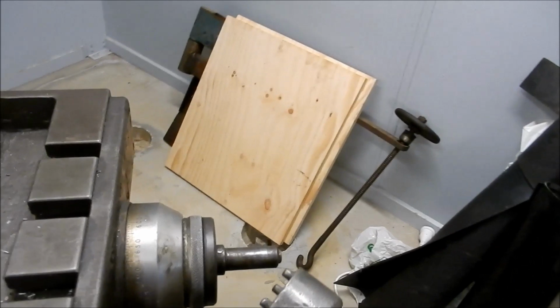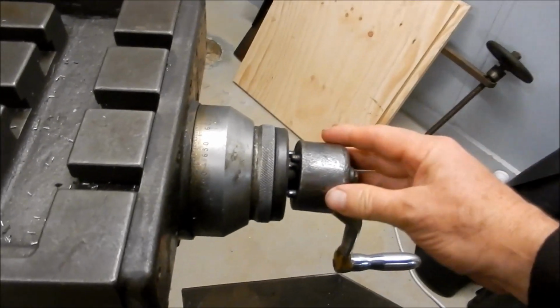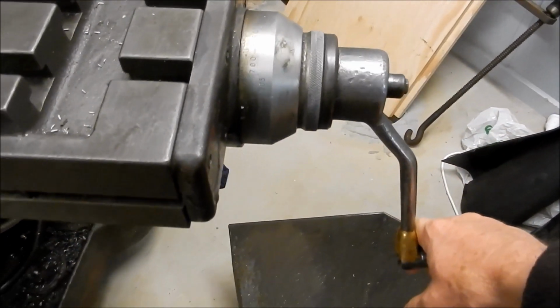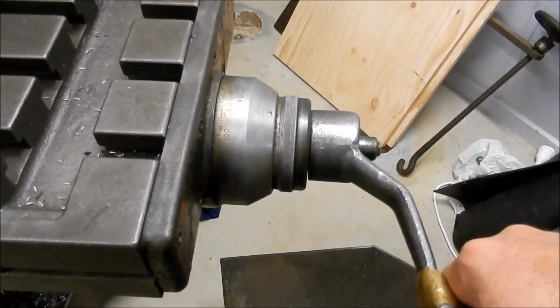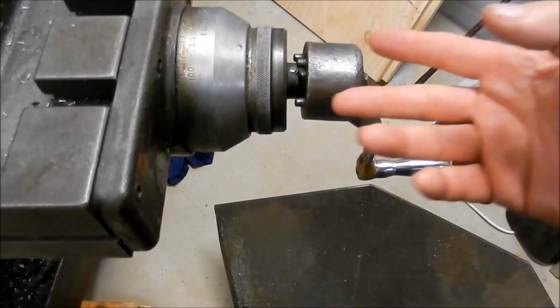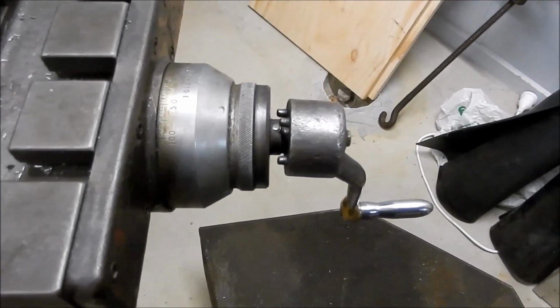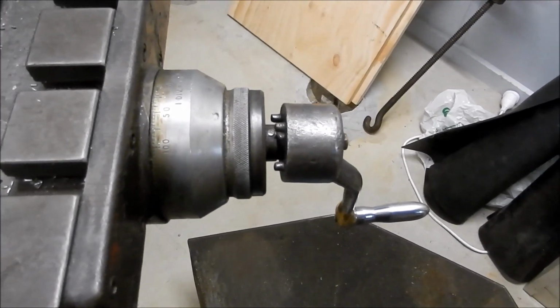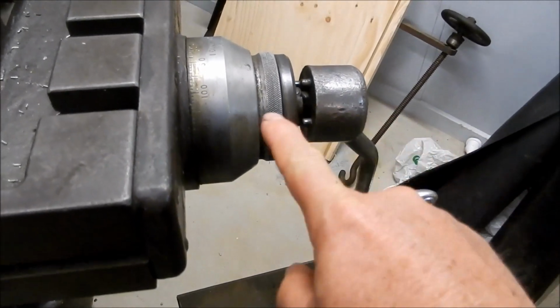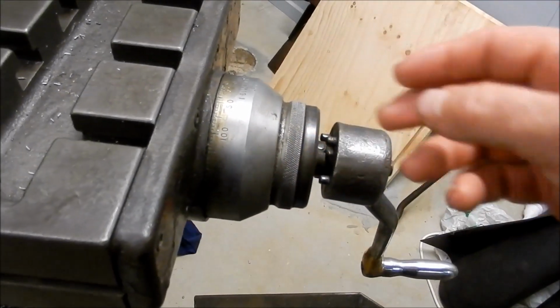But in this end here, it almost looks like it goes through a little stage gearing arrangement. It's very, very hard to turn. There are some balls inside there that I'm assuming are some sort of detent. Maybe there's a clutch that gets released, and maybe this is a drive for doing helical gears. I'm not sure. The two shafts, the input shaft and the actual screw, are on different planes, so there's some sort of transfer gearing in there.